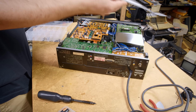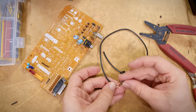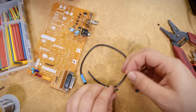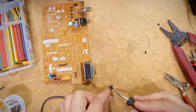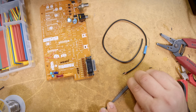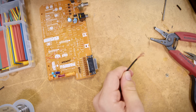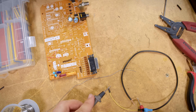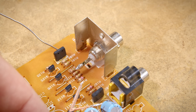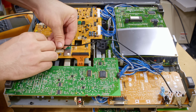The LDV4400 I'm using here has it right on a board under the bottom lid. But rather than leave the player open, it's recommended to wire this test point to an external connector. This is a sensitive signal though, with information reaching just under 10 megahertz, so you need to use shielded cables to prevent interference. The best way to do this is to run a short cable from the internal test point to a BNC jack on the rear, and then use a normal BNC cable to connect to the Doomsday Duplicator's ADC. For my setup, I decided to make a slight change from the recommended method of drilling a hole for a new BNC jack and instead disconnected the redundant composite output and routed my RF connection to that.